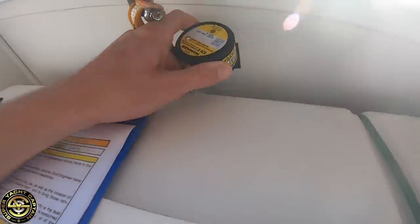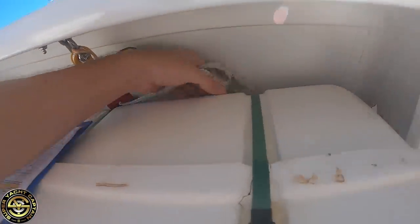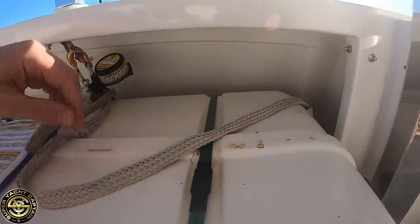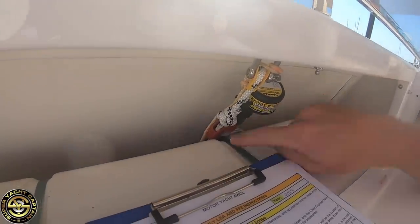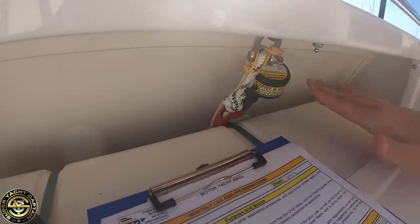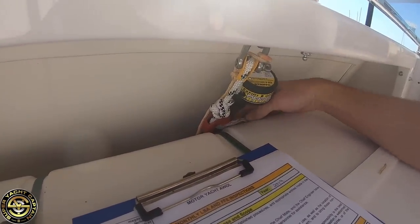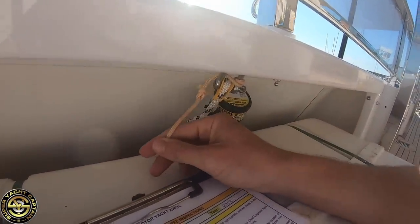These get replaced every two years. As you can see on top it has the wheel mark, meaning it's approved. This is the painter, connected to the life raft — you pull it out and it releases and inflates the raft. The painter needs to be connected to what's called the weak point of the hydrostatic release unit, shown here in red. That weak point allows the pressure from the inflated raft to break away the painter so the raft doesn't go under with the boat. This orange cord is the manual release.